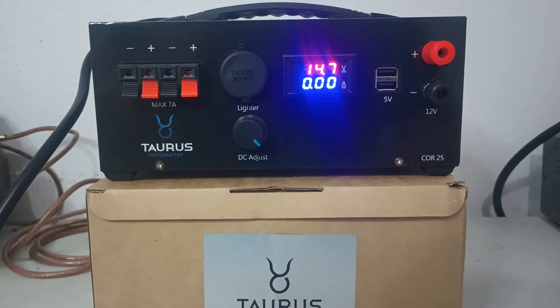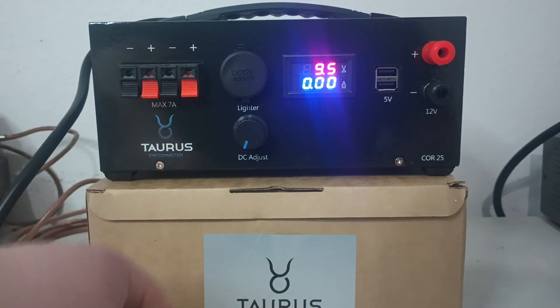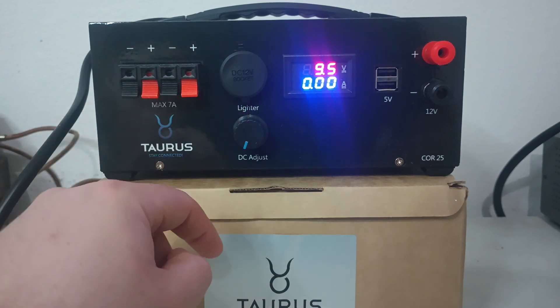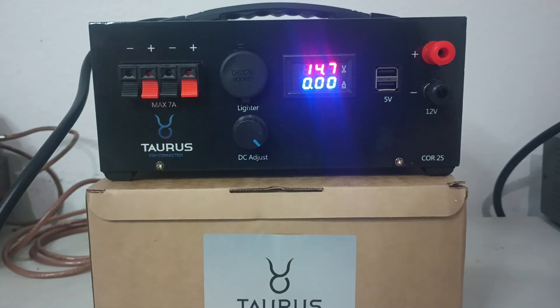You might get one that's 14.8 or 14.9 volts; if you plug it directly into the wall it may even be 15 volts — right there in that ballpark. Unless you're running something like a 2879C, you're not going to want to go over 15 volts anyway. You can see the variable voltage turn up and down really smooth. It does have a fan built in — when you turn the voltage down to nine volts or so, the fan slows down too.